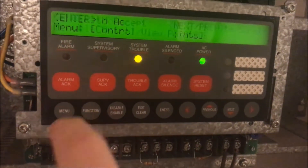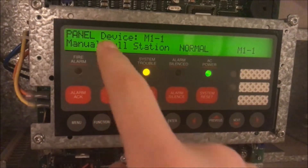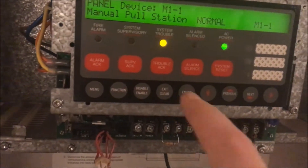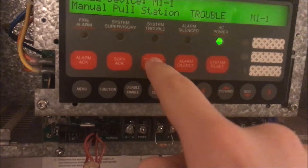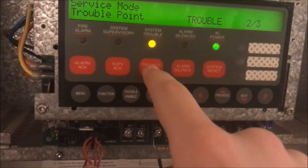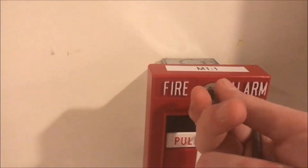You're going to go to the first menu because we are going to disable that pull station. The pull station is the panel device — this pull station here — that's what we're going to be working on today. So we're going to hit disable, set it to disable, it's going to give me a trouble. So we have time/date trouble, service mode, and pull station trouble. Now we're going to head right over to the pull station and open it up.